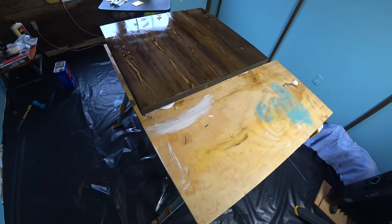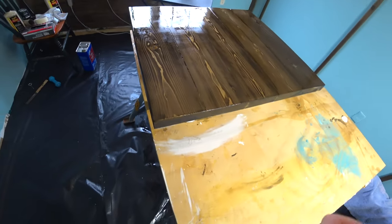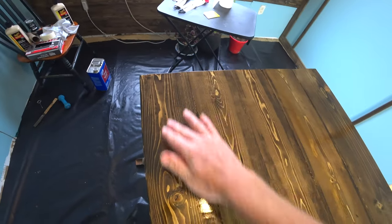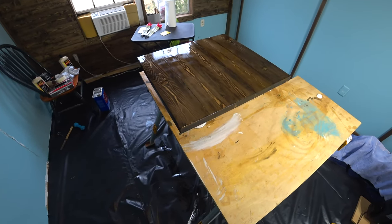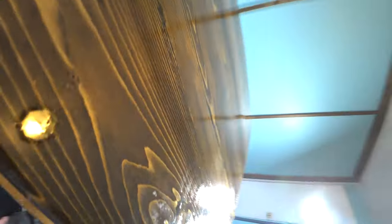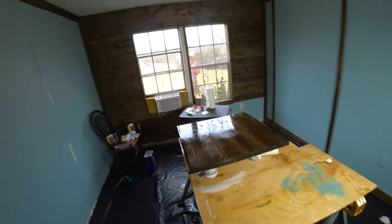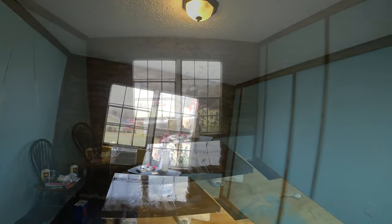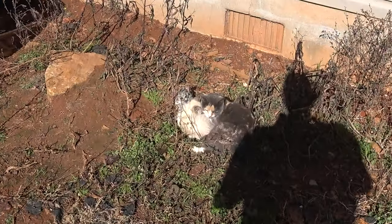I don't know what you can or can't make out, but this is what the countertop looks like after just putting that epoxy on yesterday. You can see it's definitely not level — this side seems thicker. But it's fine, cause I can hit it with a sander, take a bunch off, scuff it up. I didn't hit it with the heat gun and I probably should have — you wouldn't see all those pockets if I had. I'm just going to sand that off, blow it off. So a little bit of sanding and then a better pour this time. Make sure it's level.